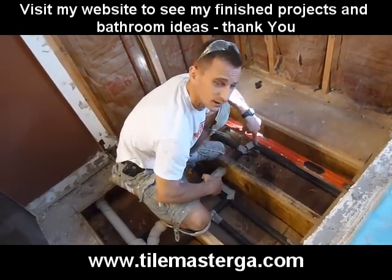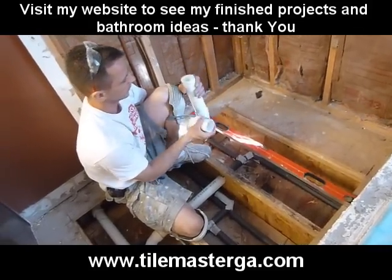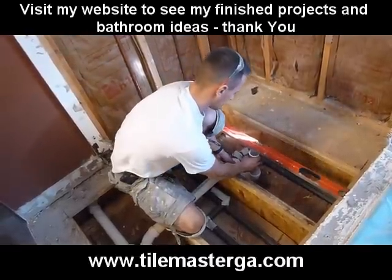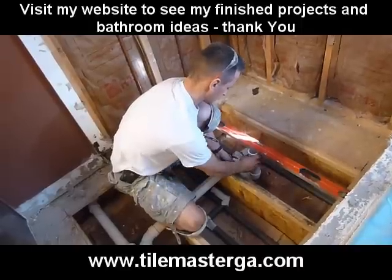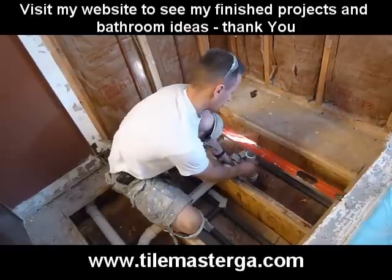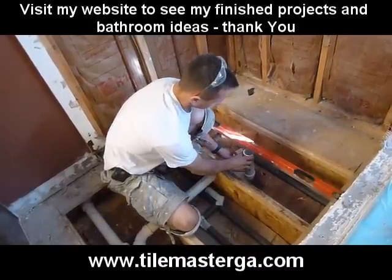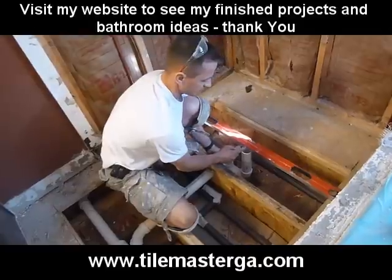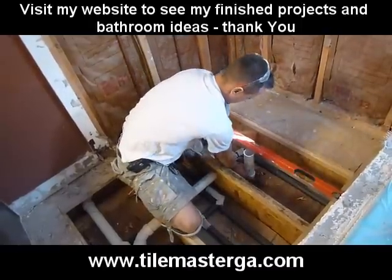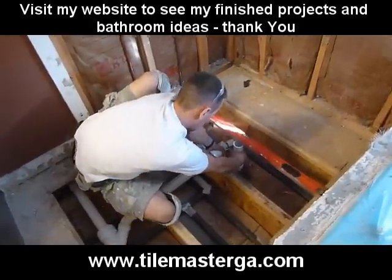So I know that this point is exactly the center of the shower. I have the new P-trap and some other pipes — I'm playing with it to see which way it will appear to be in the center, checking the length of the pipes I have to cut. I attached this longer drain pipe temporarily here, which makes it easier for me to figure out where the center is going to be. For now I'm just dry-fitting this without any glue to see how I'm supposed to glue it later.